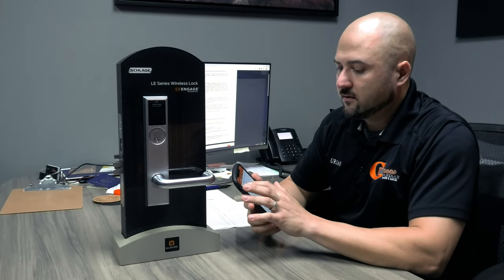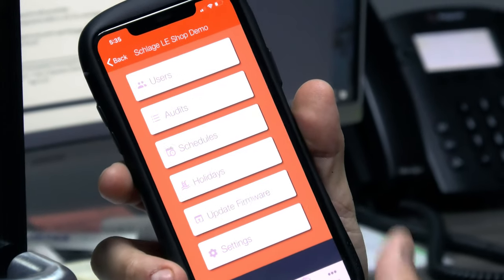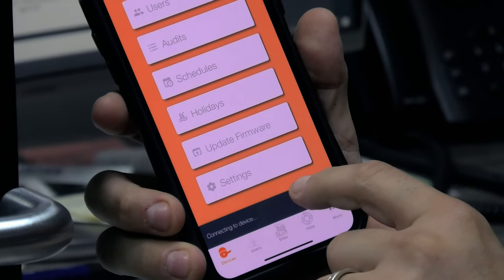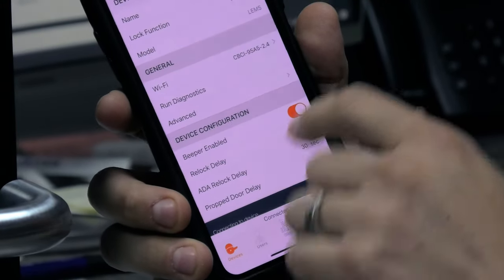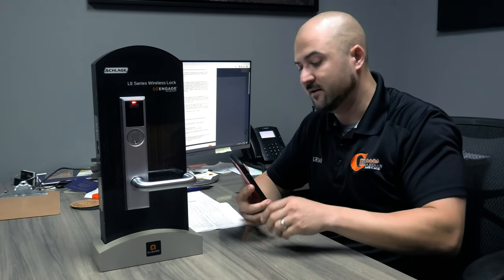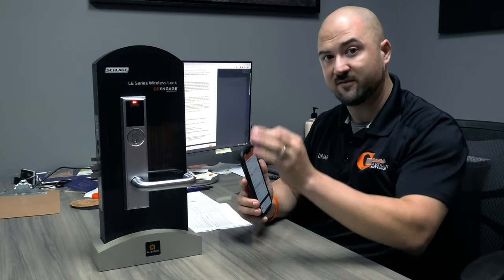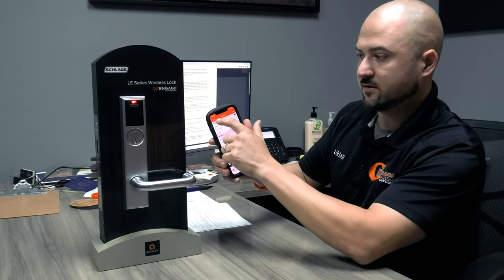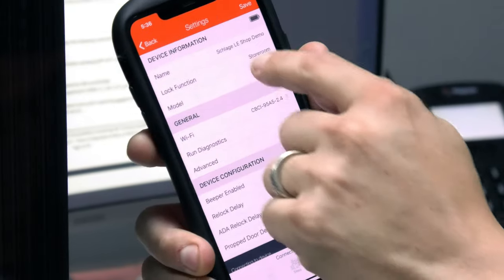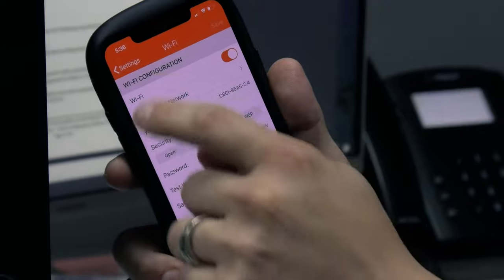Okay, so if you go back in here to the device and you hit more, it connects to the device, and then hit the settings. If your Wi-Fi has a 5 gigahertz and a 2.4 gigahertz, you have to use the 2.4 gigahertz. It does not say that in the instructions, but you have to use the 2.4 because it will not work on the 5. So I went in there, changed my Wi-Fi to 2.4, and put the password in. Under the settings over here, you can select the Wi-Fi name, type in the password, and then save that, back out,